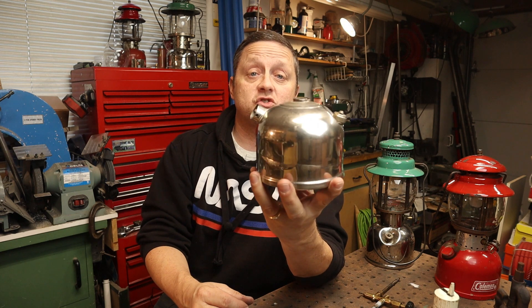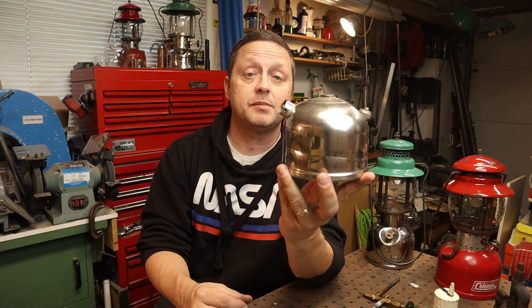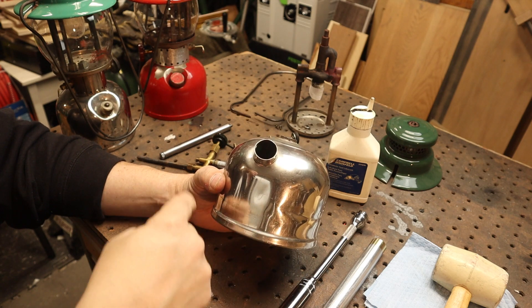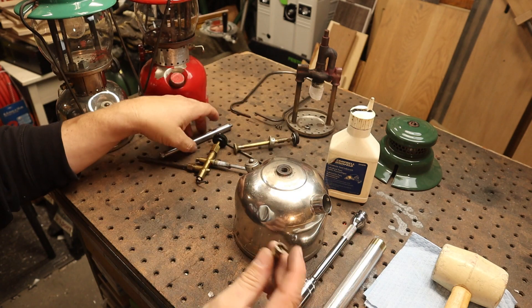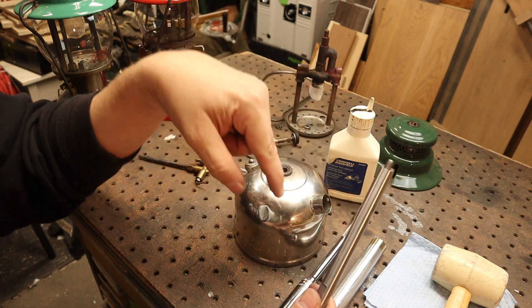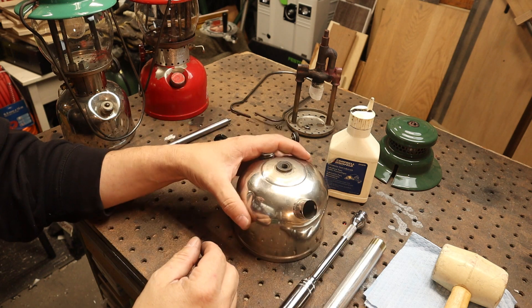The solution is to try to force something through there, and the only real way you can do that is by using some type of hydraulic method. You need to figure out how to get the stuff out of the air tube, and it's pretty hard to fish out. So what you want to do is remove the check valve — have it out — and you can use that handy dandy check valve removal tool. I'll put a link in the description below. Pull the check valve out because you don't need it in there.